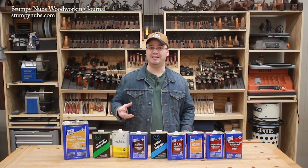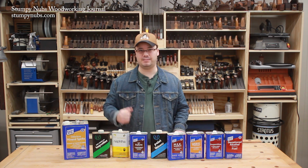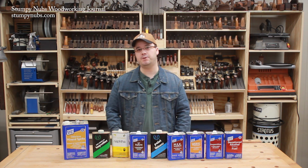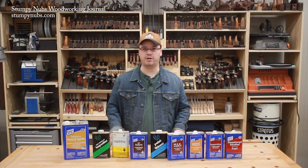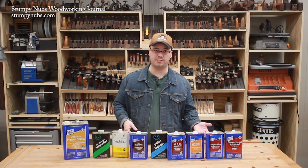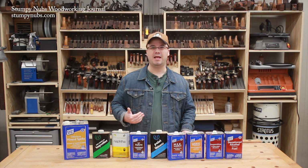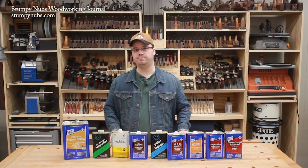And they're also pretty powerful solvents. They can be used to clean up superglue and epoxy before it hardens, for example. They'll quickly dissolve grease and adhesives, including contact cement and the polish from your nails. MEK is a harsher chemical than acetone, but even acetone is pretty harsh. Some companies have developed alternatives for those that must use it to thin special coatings like fiberglass resin, but the only real use I've found for acetone in my shop is to remove things like Sharpie marks, and I don't use MEK much at all.